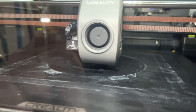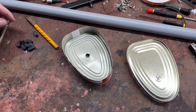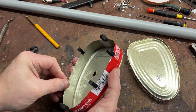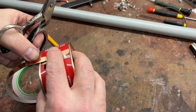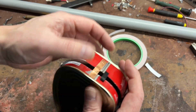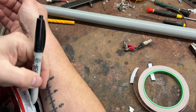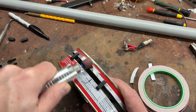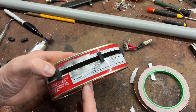Of course, we have to hit the 3D printer and make the 3D parts. Let's attach the 3D print pieces to this can and join the top half to it. You'll notice that I've sanded out a section that we can put a jumper on there to effectively turn this into a slot antenna. Next is to find the perfect feed point. In this case, it's a by-guess-by-golly, and I've taken my handy dandy tattoo ruler and figured out that between 3 and 4 inches seems to be about the right spot. I taped down the connectors for the feed.